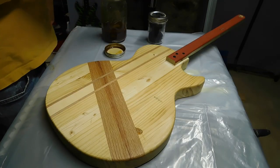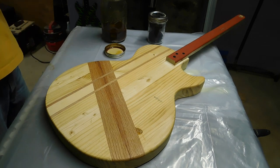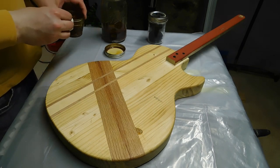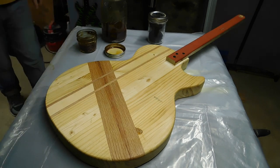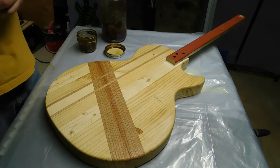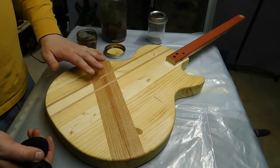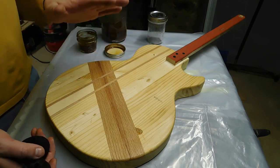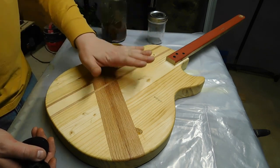As I mentioned, I sanded this up through 80 grit, 120 grit, and then 240 grit, and I've put a couple of quick coats of the two-pound cut of shellac on here. Now as you go down through the layers of shellac you're going to want to make it a thinner and thinner cut — more solvent in it to help smooth everything out — but when you're starting you need those heavier coats to start building up something. I made the mistake of starting with a thinner cut because I was concerned about ripples, but the problem is that solvent just wipes away the previous layer and you keep working against yourself.